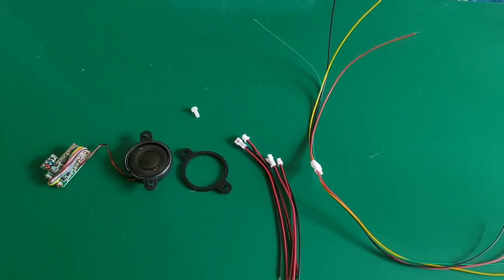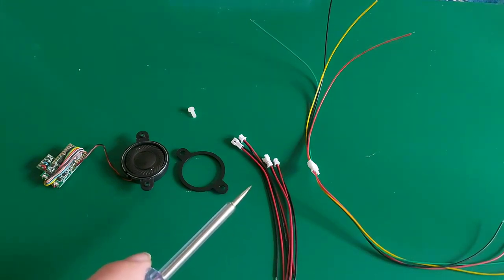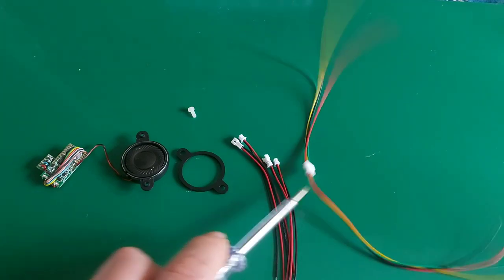The main things I need are a TTS sound decoder for Britannia — it's R7143, still available on eBay at the time of making this video. It has been replaced with the new Hornby HM7000 Bluetooth decoder, which requires a sound download available for the Britannia class. The principle of fitting is the same for this non-DCC ready locomotive. I'm also going to need some connectors in case I want to connect the speaker away from the decoder, for power and speaker connections.